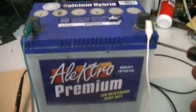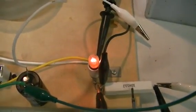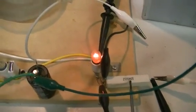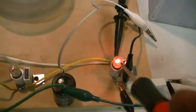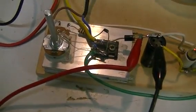From the positive side of our battery we're coming down and going through this 1 ohm 10 watt CVR — quite heavy enough to do the job. We're going through a visual resistor, so we're coming out of the CVR and through our incandescent bulb. This is the 12 volt bulb — you'll see it is lit. We come out of our 12 volt bulb and go to the positive side of the run coil. Negative side hooked up as per usual.